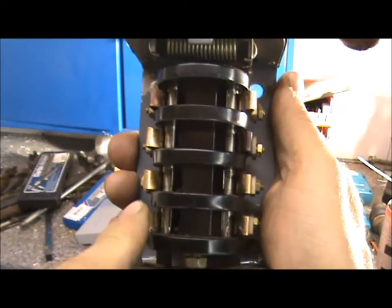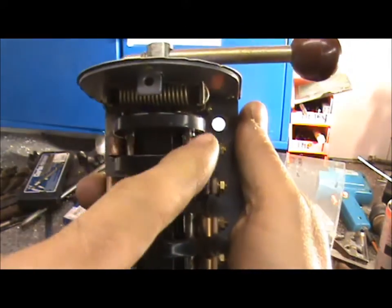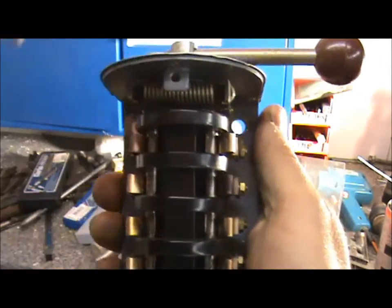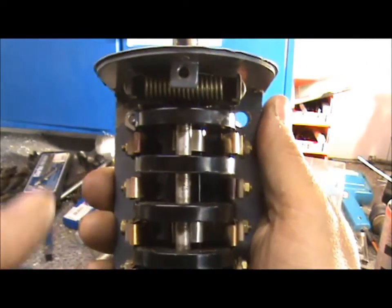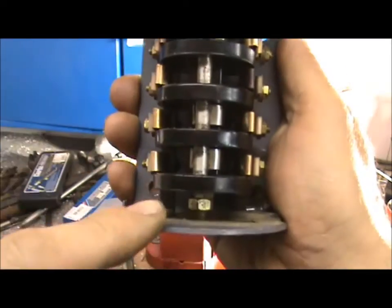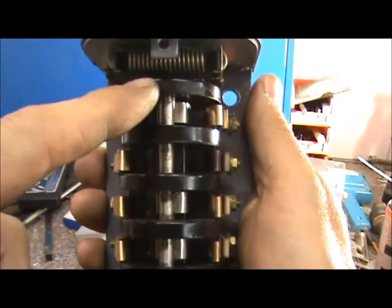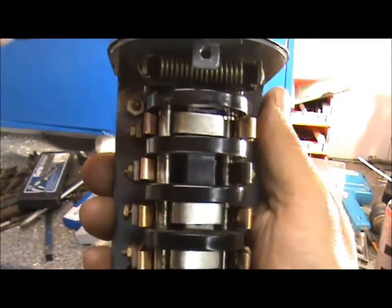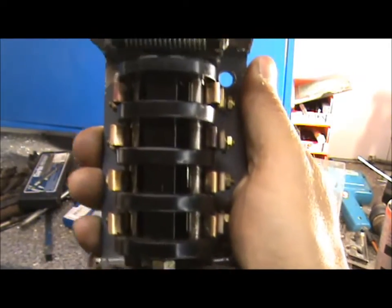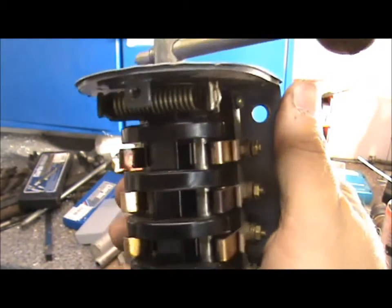It does not, like a rotary tumbler switch, fold electric to that corner or fold electric to that corner. There's no facility to do that. So I've come to the conclusion, if I make some new brass pins and drill a hole for it and put a wire in it there and there and run the motor power to them, when I switch it that way, the motor will go forward, and when I switch it that way, the motor will go reverse. So I'm going to make them and wire it up and give you a show.